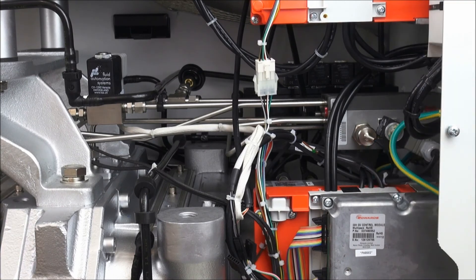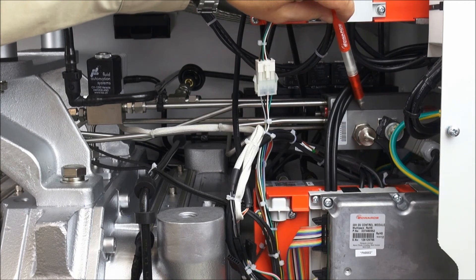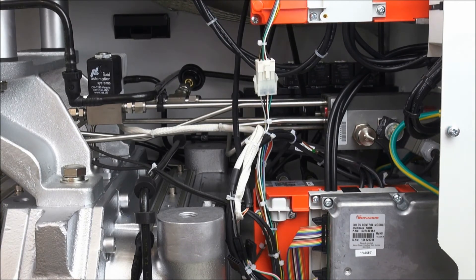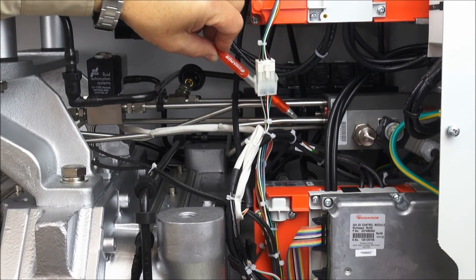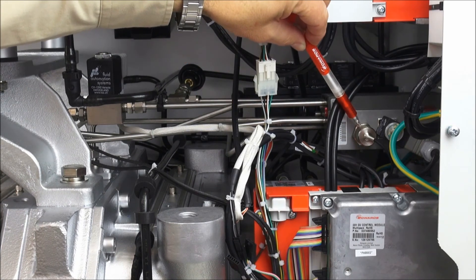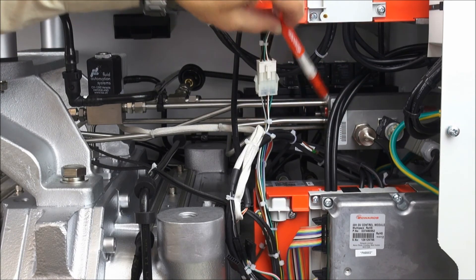All of the purging on the GXS is handled and controlled by the purge gas manifold block which you can see clearly here, and all its connections through to the different ports to feed the purge gas through. On this GXS 450 screw pump you can see two controls for the gas ballast: gas ballast one has a manual needle valve, and gas ballast two has a solenoid valve which can be commanded open or closed. The line going through to the exhaust port allows the exhaust pressure sensor to sense the exhaust pressure, with a very small flow of gas going through it to keep the line clear.